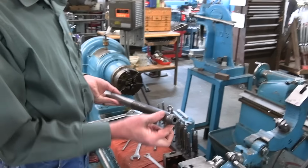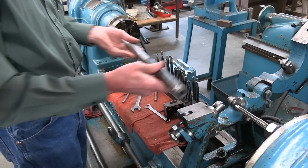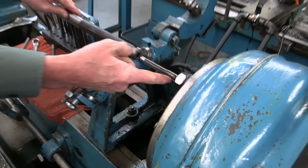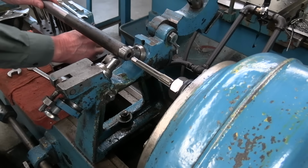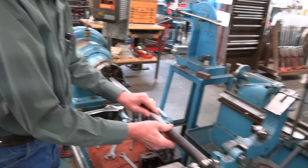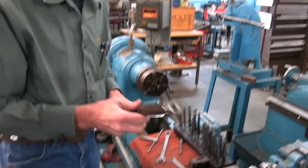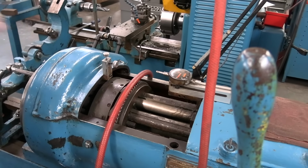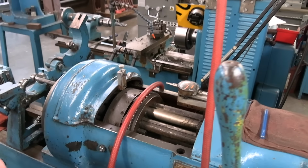This has all been machined and concentric with the hole. It'll go in here. And this is how you put whatever caliber chamber you want in it. Carbide reamers. This here is how you set your headspace, so you don't go too deep with the reamer or not deep enough. You come over here.